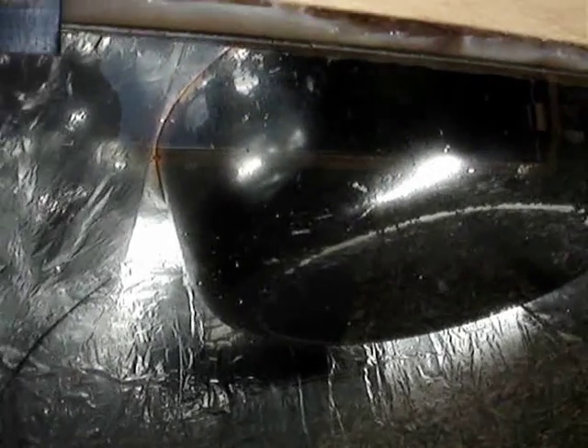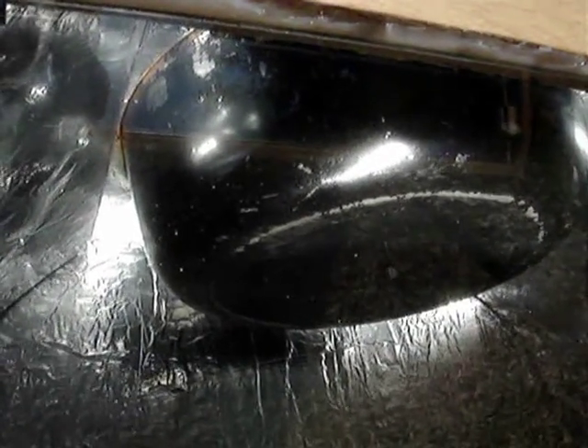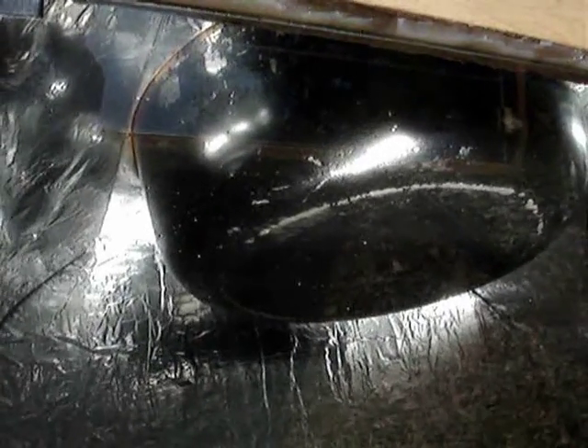If we look upward in the vicinity of the pot, we see again as we vary the concentrator angle to follow the motion of the sun across the sky, we can center the reflection of the sunlight into the middle of the pot. You see a mirror on each side, which is designed to catch the sunlight that would miss the pot on the side and to direct it toward the pot in the middle.